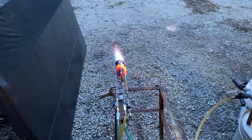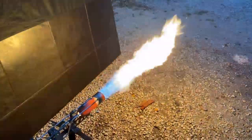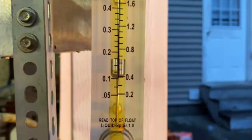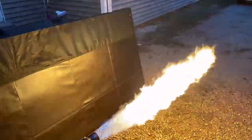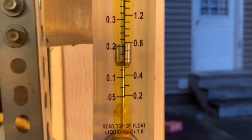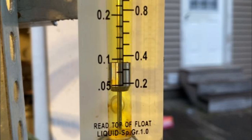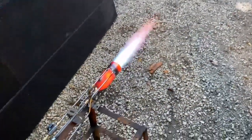You can see that tank is just engaged, slowly dropping — nothing real drastic. I think we're going to be able to melt a couple crucibles of carbon steel with this thing no problem. Just wanted to show you guys the different flame settings this thing can do. That right there looks like about five and a half to six — that is about 350 to 370 kilowatts or so. And I'm going to turn it up all the way — that is right around 500 kilowatts of power, maybe a little bit more, about 550 to 600 kilowatts. This is where we would be running it, which is right around 180 kilowatts, about four cubic feet per minute at about 75 psi of air pressure.